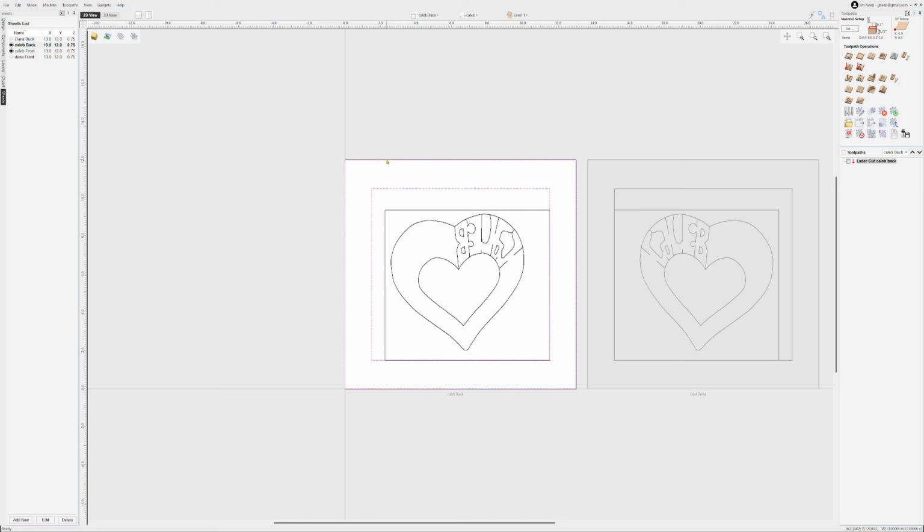So I copy that piece over directly, and you can also see up here on the left, my workpiece size is essentially this cardboard, this overall cardboard frame size. So it's not the actual material I'm cutting in this case, it's the bigger frame or alignment jig that we're using. So I've copied over this rectangle as a group, and then I've copied over these two items, and it makes sense, or it works better if you group these so that you don't accidentally move.